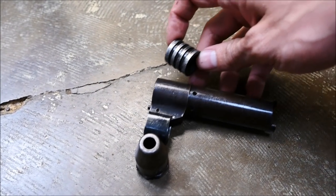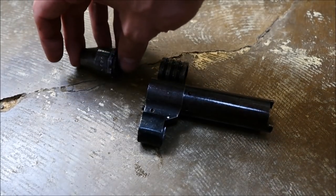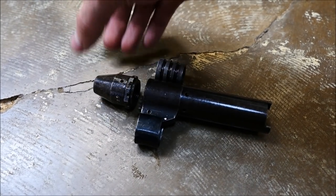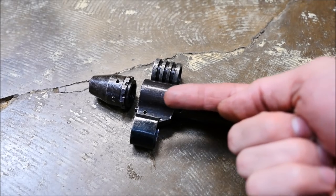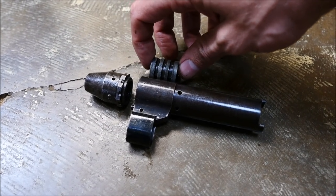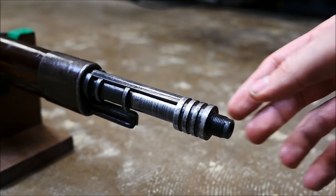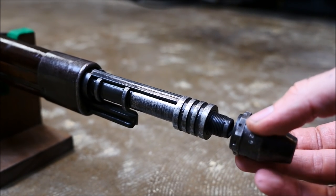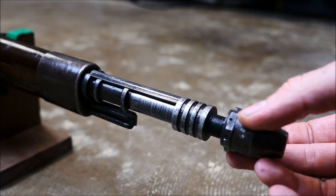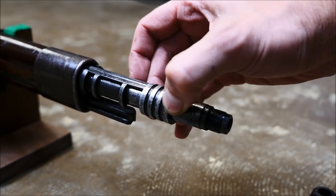So the bullet comes out, gases are redirected into that sleeve, and that actuates the piston and moves it backwards. With each shot, the gas would be redirected backwards by hitting the front of the nose cone, smashing into the op-rod, and the op-rod runs the length of the top of the gun — that is what actually unlocks the gun.